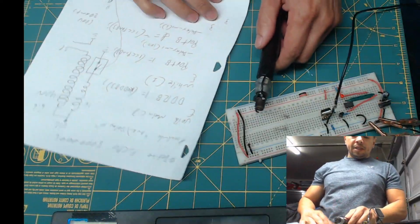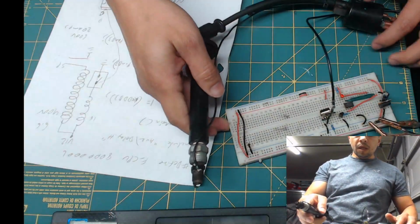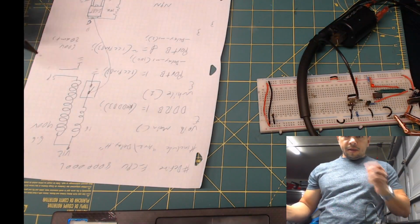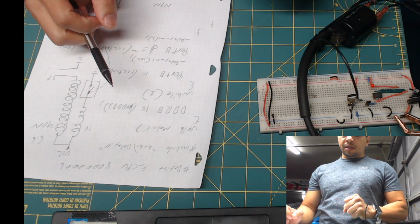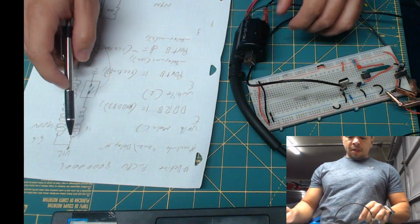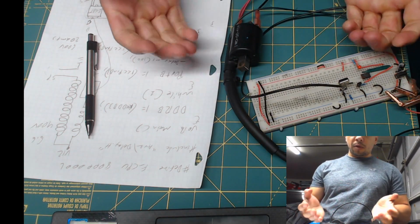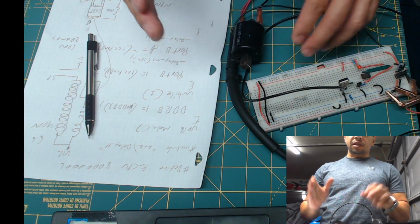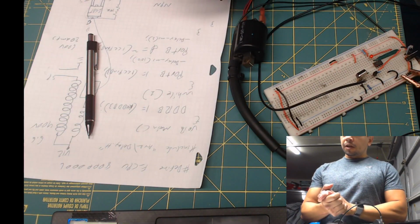There you go. So that's it. That's how you control an ignition coil. Now on the next video, I'm gonna show you how to detect the ECU when it's holding it down and when it's releasing it, so we can delay it. Right now we're just controlling this. We needed this so we can create the actual QuickShifter without having to plug into the motorcycle. So by having two coils, we should be able to test just like if we were connected to the motorcycle. So until next video, have fun.